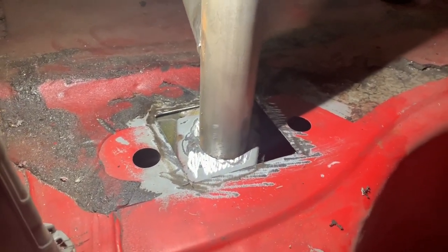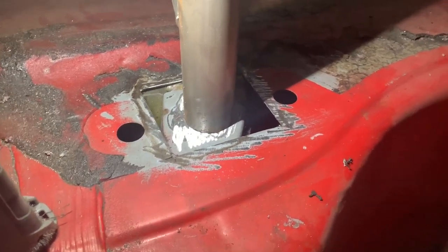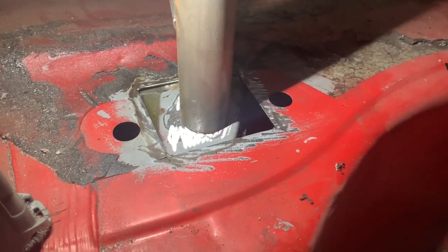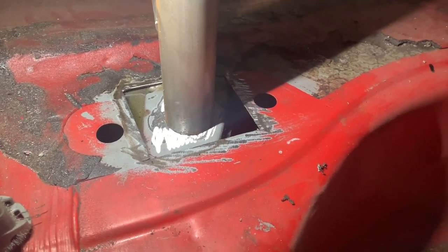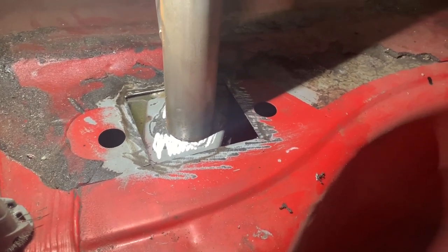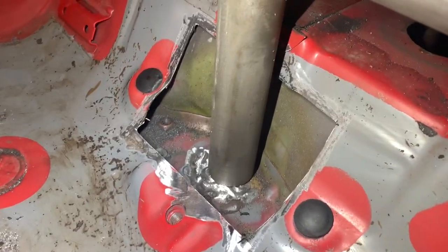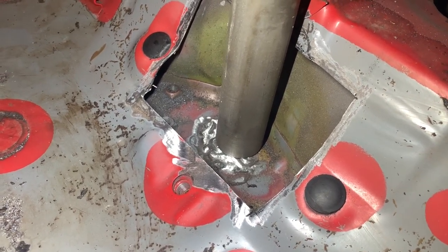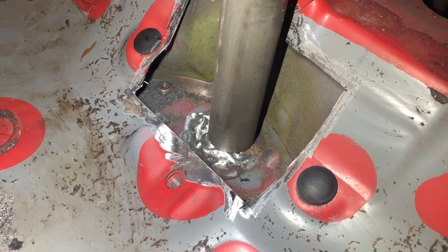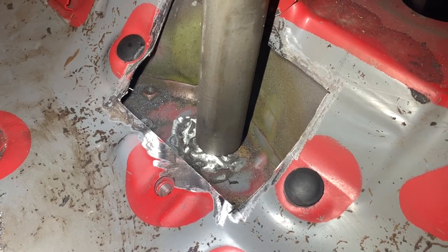It's obviously very important to remove all the paint so that you have a good surface to weld. The gray stuff is actually some kind of primer — it's not super thick, very easy to take off. It's a very weird shape over here, so use some kind of wire brush on a drill or something and remove all that material.